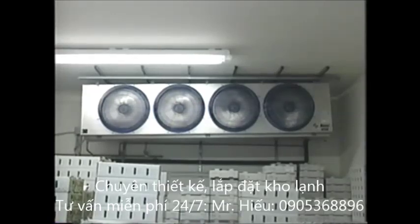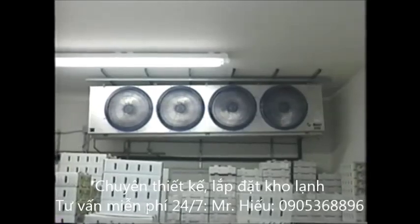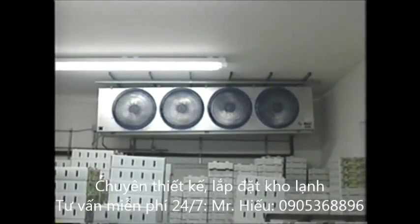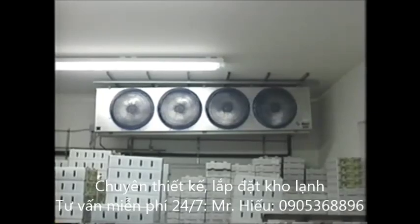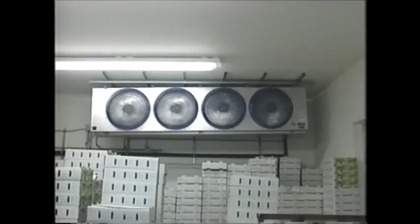You can also order UC Leaflet 21449, which has a method for estimating refrigeration needs. High humidity reduces product moisture loss, and the system should be designed to provide at least 90% relative humidity in the cold room.